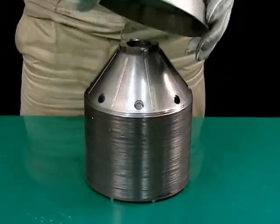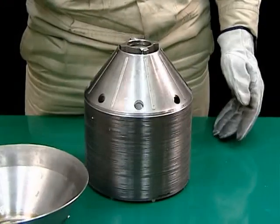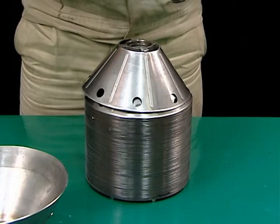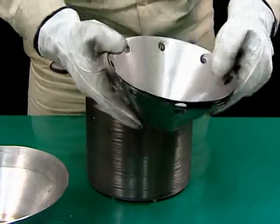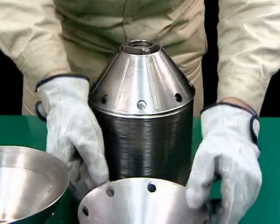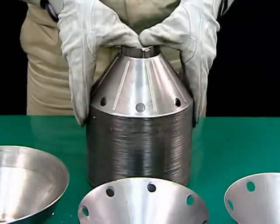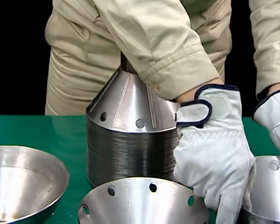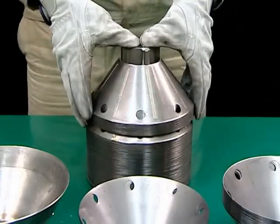Do not use metal or sandpaper to clean the removed discs. Scratches on the surface can cause sludge to accumulate on the surface more quickly. Instead, soak the discs in plenty of cleaning oil or detergent. When the sludge has softened, clean with a soft utensil such as a bamboo or plastic spatula or sponge.